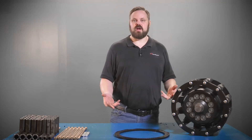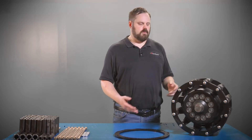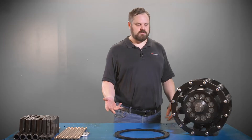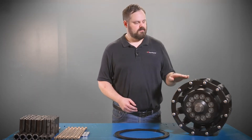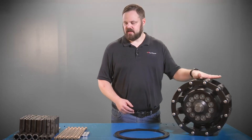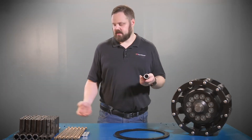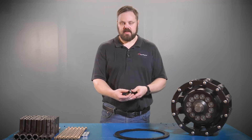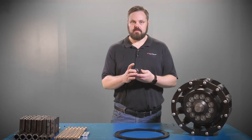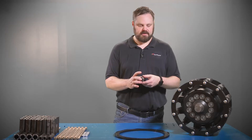Other than turning the track, you'll find this sprocket is rather unusual compared to your Bobcat, Takeuchi, or Kubota models. It actually has a two-piece roller design that slides across one another. You have your outer roller on the outside and your inner roller, where they spin together. The inner roller remains stationary while the outer roller spins over the top of it.